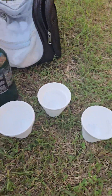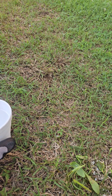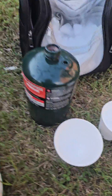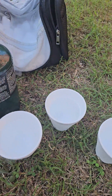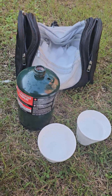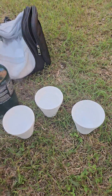Hey, does anybody want some liquid propane? It's — you know, try some. Seriously, this is not safe stuff to be drinking, that's for sure. But what I did is I actually saw some tutorials, got some dry ice and stuff, and I basically cooled this propane tank to below zero temperatures, below the boiling point of propane, which lowered the pressure inside of the can, therefore giving me liquid propane.